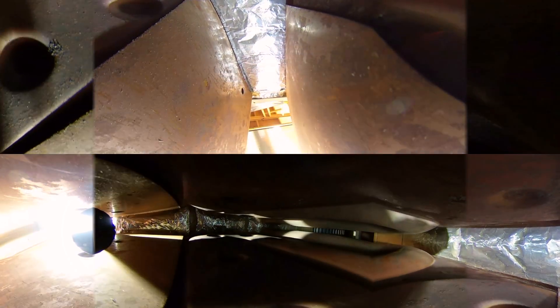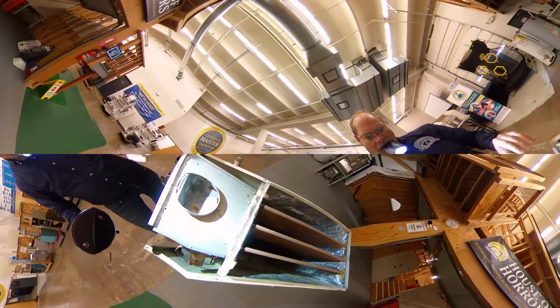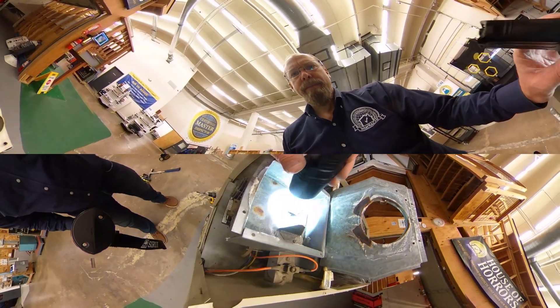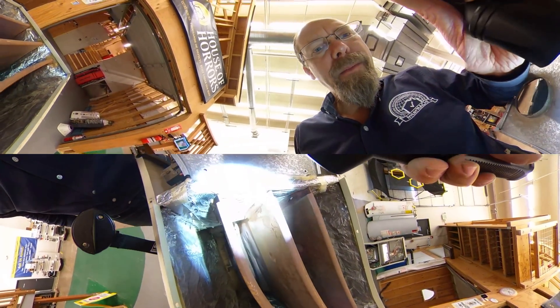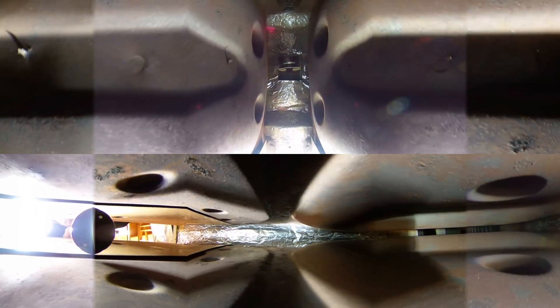Not much to see. If there was a crack, it would probably be difficult to even see it using a camera like that. The exhaust fan is there, and there is a cutoff switch — a temperature limit switch. It's hard to see, but it's inside there in the middle of the exchanger components. It just senses temperature; if there's a problem, it shuts it off.